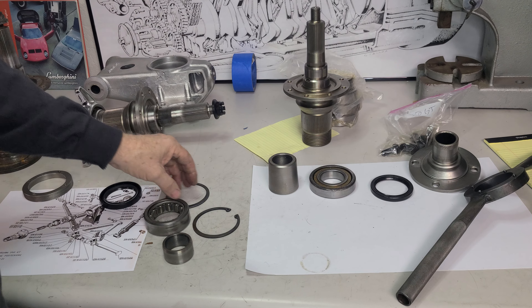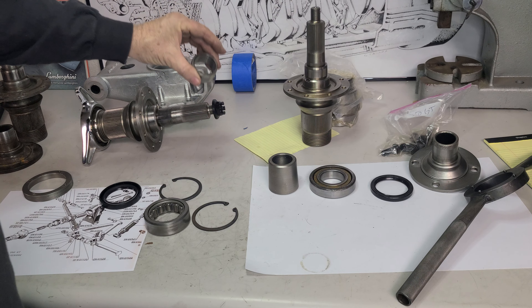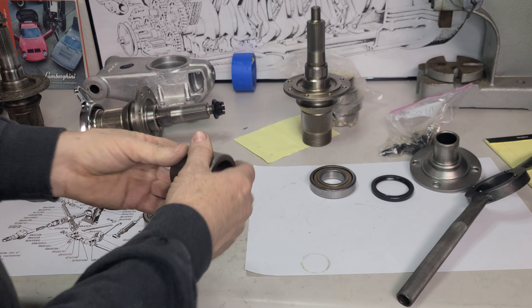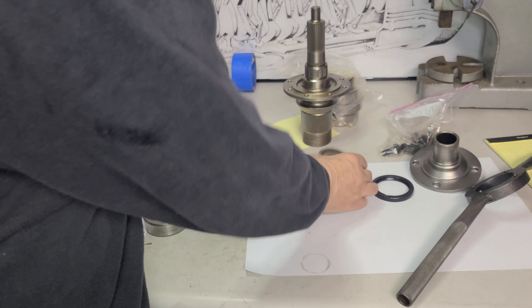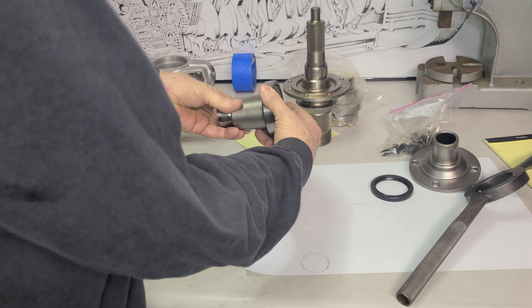The bearing goes in and we hold it in with these C-clips. A new inner race has been pressed onto this. We have a collar here — this is a tension collar. It goes on and hits right here, so all the pressure is right in the center with no pressure on the actual bearing. To keep it all together, this collar screws in. The factory tensioned it up with a special machine, then drilled and tapped it — that's where the set screw goes. You have a specialty tool with pins that line up with this, and then you screw it in.